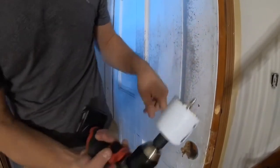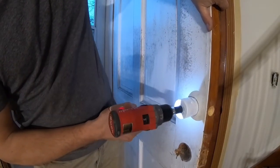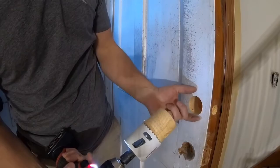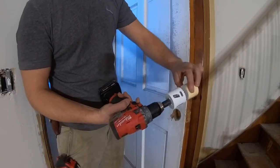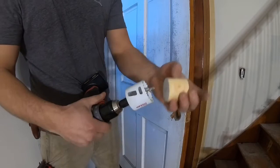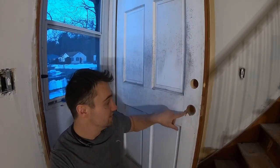Flip the door open — you'll have a small pilot hole to center from — and start drilling from the other side to finish. There you go: it's nice and clean on both sides. The door handle plate is a little bigger so it covers any roughness anyway. If you go about three-quarters of the way from one side then flip it to finish from the other, the bit doesn't get stuck. Otherwise you can use a screwdriver to pop the wood plug out, which is a bit annoying. This one is slightly damaged so we'll putty it up with Bondo. I have a video on how to fix wooden doors if you're interested — check those out. Thanks for watching and see you next time.